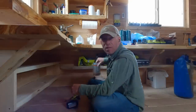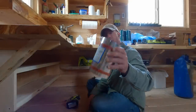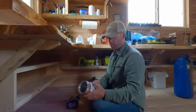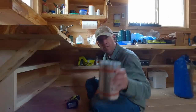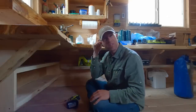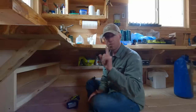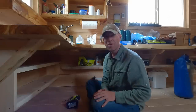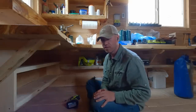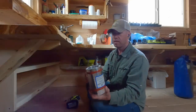While I'm doing the wiring, I've got this roll of aluminum flashing - six inches by fifty feet. I'm going to use this to wrap the legs of the cabin. There are about nine legs total that are just the boughs from a tree holding this whole thing up. I'm going to wrap each one - it'll keep the mice out. They're just appearing right now; I don't think they hibernate. The flashing is nice and slick so they won't be able to climb up the legs.